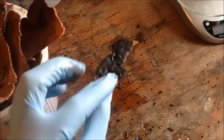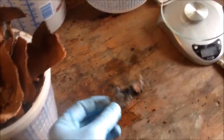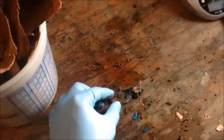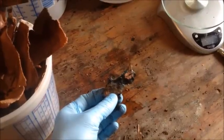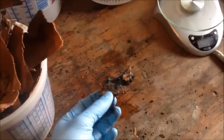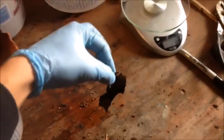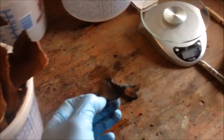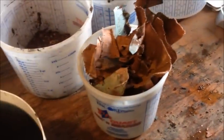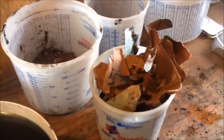Here's a piece of one of our anodes. As it plated there was a section above the solution that didn't plate out, so when the anode got down to about ten percent remaining copper I turned it over — that thick section went into the solution and I clamped it at the thin part up top. I'm left with about 20 grams of copper that I can put back in and use as collector metal, so nothing is lost.